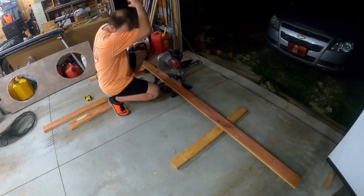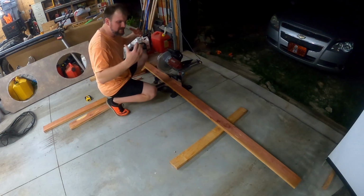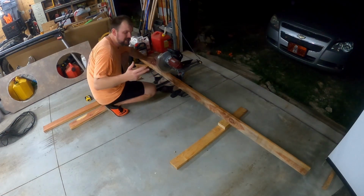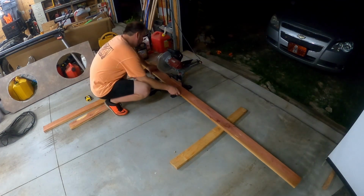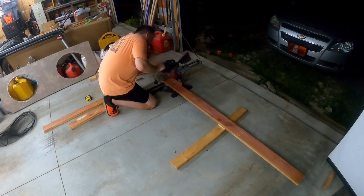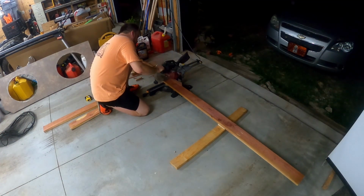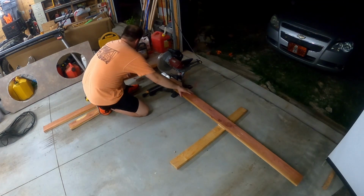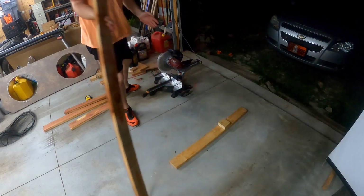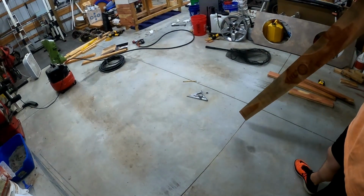All right, this is our front board. With this rough cut, you select the spots that you don't want showing, as when we turn this outside, it's nowhere near the red, purplish color that we're looking for. So you've got to pay attention to that. And of course, when you're doing finish stuff, it does have to be very close. So line up your saw blade properly, because you don't want to be an eighth of an inch long or worse, an eighth of an inch short on a big long board especially.